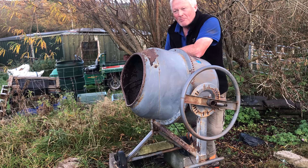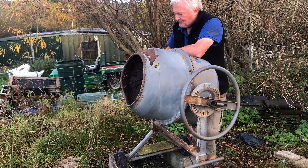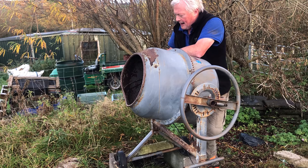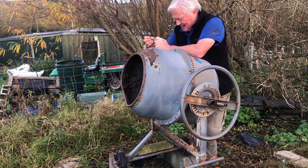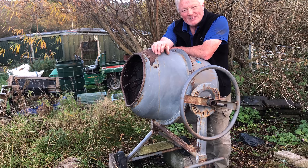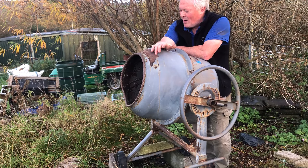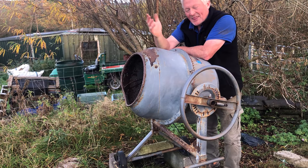So I took a punt and bought a motor that's suitable for a Bell mixer. Bell cement mixers are one of the best brands of cement mixers on the market — all the builders use them. The bad news is this electric cement mixer didn't have an internal thermal cut-out switch, so if the motor struggled and drew too many amps, it wouldn't trip. I've now fitted a 10 amp manual reset switch — 10 amp is a bit too high, but better than nothing. This mixer runs at roughly 32 revs per minute when really you're looking for 27 or 28, but it is what it is.